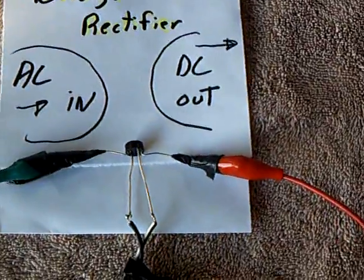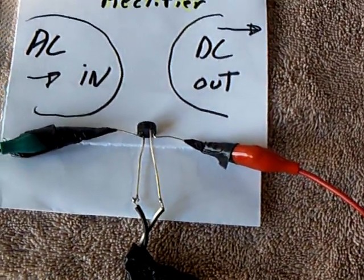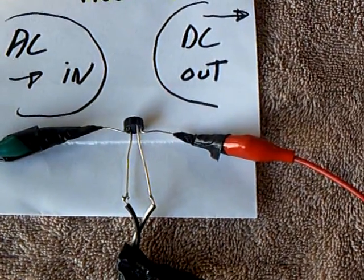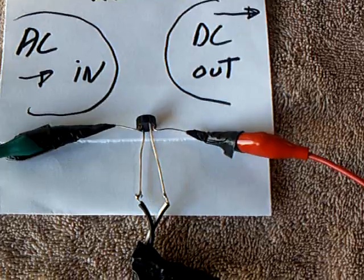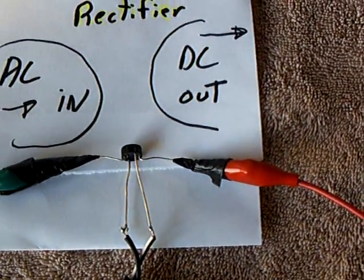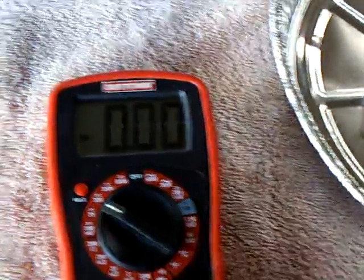I went away from diodes and went to a straight bridge rectifier. I decided that what was coming in off the ground and the antenna was some sort of AC, I believe, because when I put it through the bridge rectifier it worked quite well. So the ground comes in through there, and the antenna wire goes into there, and then coming off down here it goes into the meter. It lets me see what's happening as far as voltages are concerned.